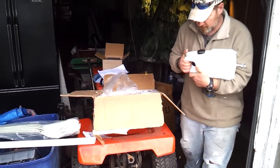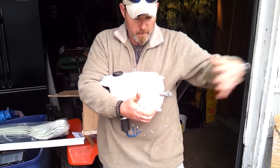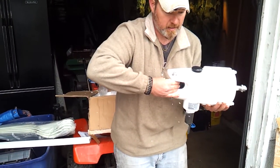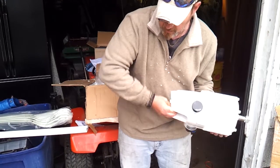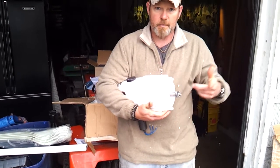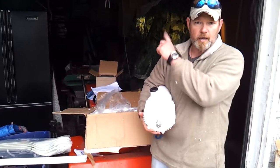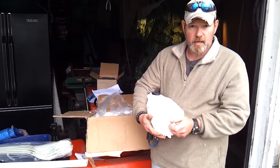For anybody that doesn't know how the furling tail works: you've got all the blades, and if there's a tremendous force of wind against this, the tail connects here with an offset. The wind turbine will kick sideways — my arm would act like the tail — and then the tail will catch up and it'll slow itself down automatically, without needing electronics to engage an e-brake. In the event of a hurricane or tornado, you go ahead and hit the manual brake right on the charge controller. Otherwise in high winds it'll tend to itself.